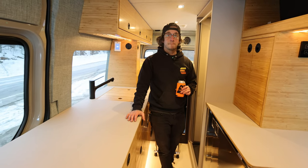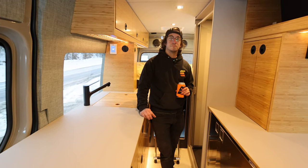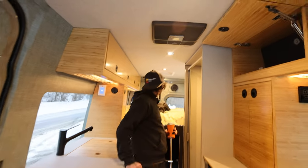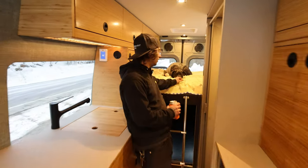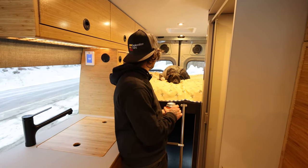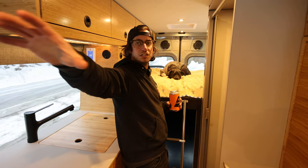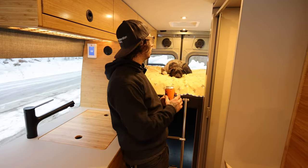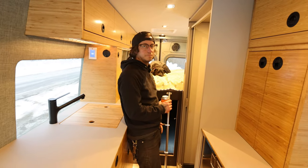A lot of your ceiling is based off of what's on top of the roof. So you elected not to have a max air right above your head — you went with the max air in the rear and an air conditioner right up above. Why? A lot of people are picky about cold air falling directly on them while they sleep, and we know cold air falls. So if you want a cool comfortable space but not be pummeled with cold air, having it here really does increase the efficacy of cooling the entire space without being uncomfortable. People are worried about venting when you're cooking — but we're in 90 square feet, you can definitely air it out.